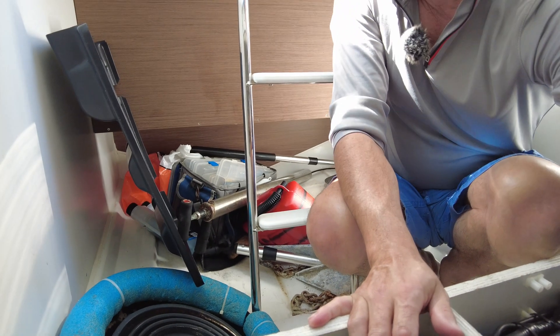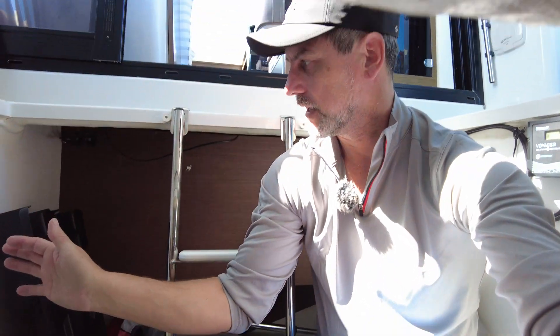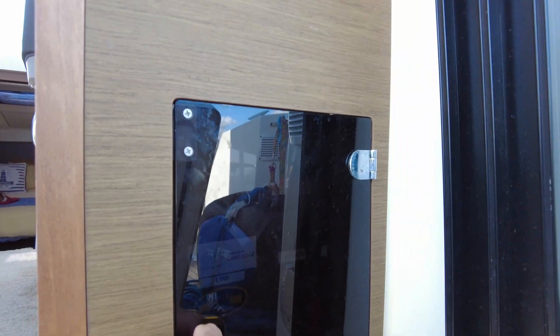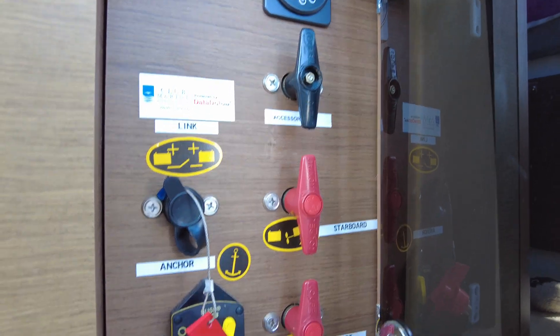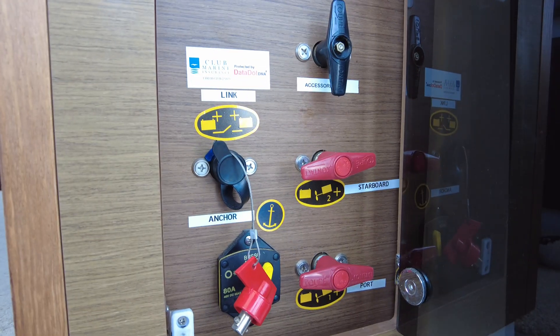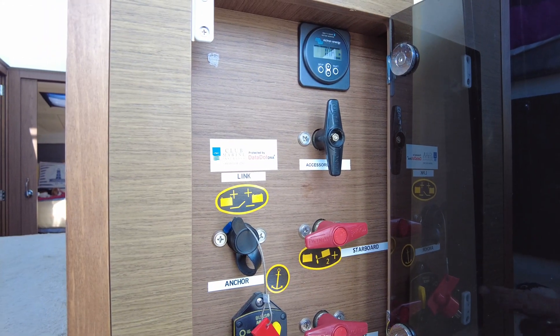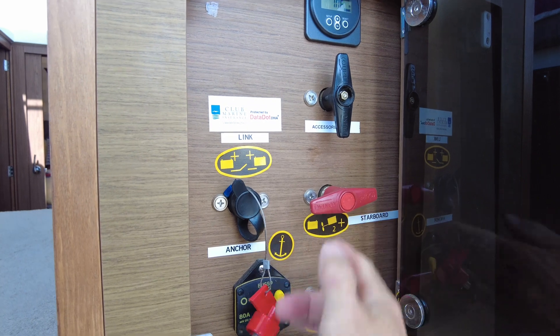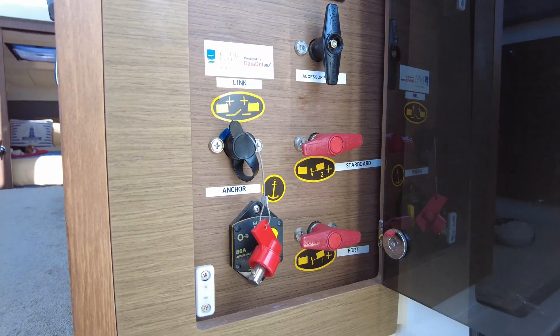The other thing is it does mean I'm going to put a bit more stuff in here — it's a bit of a mess at the minute, they kind of just threw it all in there, but we'll sort that out. I'm very happy that they didn't put an extra shelf in here. So it means I've got that long space because I do fit a surfboard in here. The other difference is in our isolation cabinet. We now have three isolators and they're all labeled correctly and doing the right thing. One for the VH starter battery — so we can isolate those when we're at anchor. And this one is isolation for the accessory bank or the house bank. That will merge the two starter batteries. I didn't get another key to merge all banks together because if you've blown up your starter batteries, you're really in a lot more trouble than that.